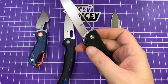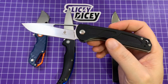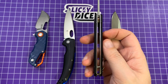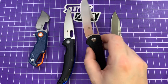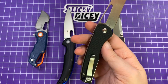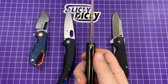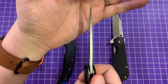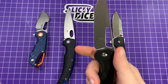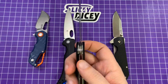Action is good — you can spidey flick it, thumb flick it, all that. It's not going to be drop-shutty because it's on washers, but that's fine. Overall length of 7.8 inches, blade length of 3.4 inches, blade thickness of just 0.11 inches, handle thickness of 0.5 inches, and a weight of 3.51 ounces according to my scales — which is exactly what they claim. Golf clap for accuracy. At 17 thousandths behind the edge with 0.11-inch blade stock, it's a really good slicer yet still retains a great tip. I think the high point of this knife is absolutely the blade. At $52, this is a pretty compelling purchase.